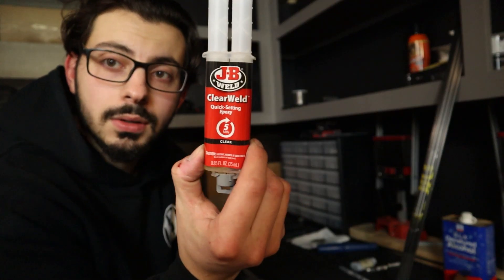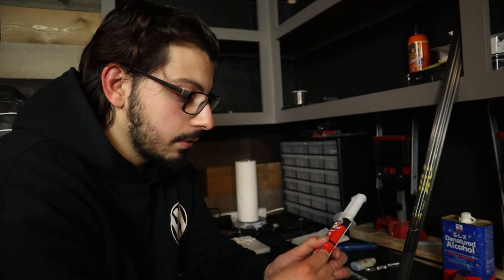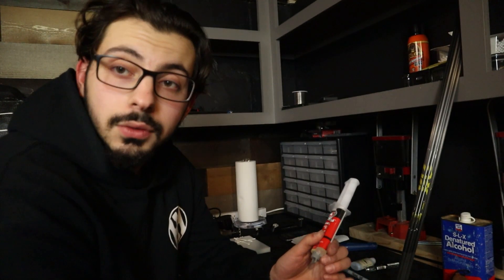I have been using this 5-minute clear weld epoxy from JB Weld. It seems to work really well and it's reusable — it's got this little cap that you just twist on and off when you want to reuse it. In the past, I generally like to use that 24-hour Easton Hit Epoxy. Those things work really well. Generally, the slower the epoxy takes to cure, the stronger it's going to be and the less brittle. Usually when things cure really fast, they tend to be brittle.